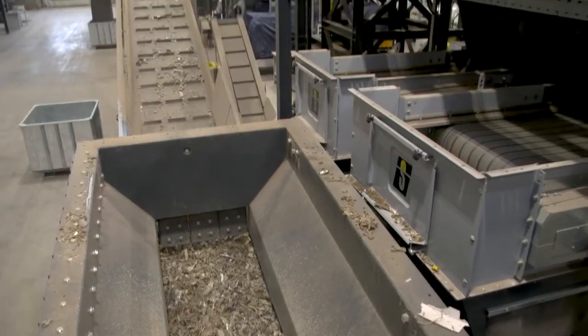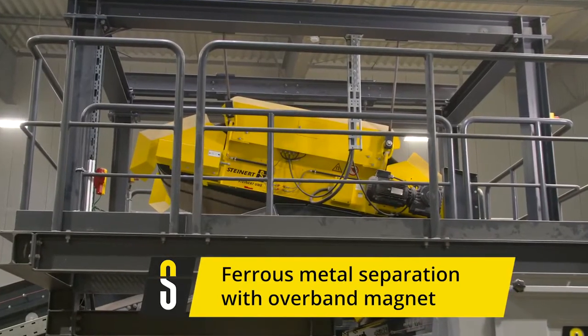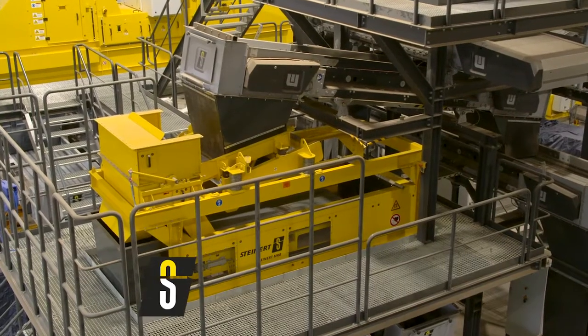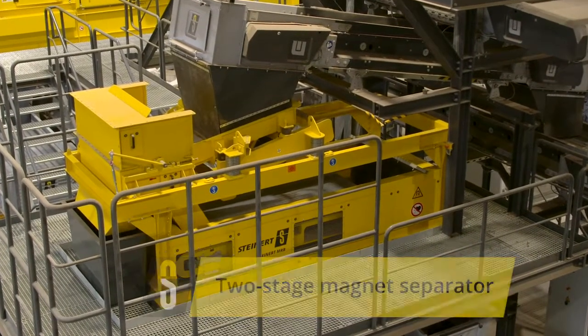The processing line is equipped with different magnetic separators. These vary in material removal method, either pickup or overfed, and with regards to the magnetic field strength. This provides a choice depending on the requirement between quality of magnetic product and the extent of the ferrous removal.